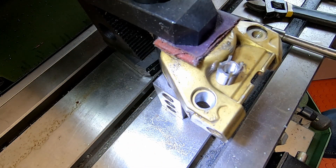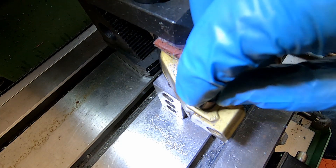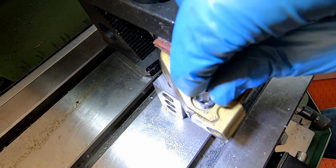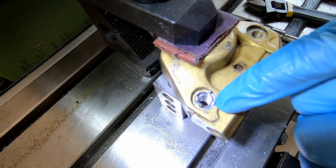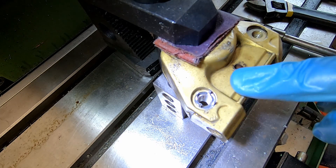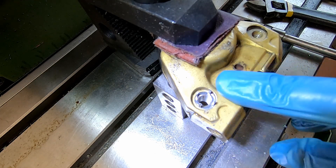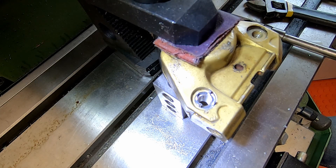This now gives you a close-up of the hole that we've drilled and tapped, and this is our pin lock insert which will screw inside there. You can see how the mechanism works — once this screws in, it'll get down to a certain point and it should start to snag. That's down to its optimum point because these pins are beginning to interfere with the thread. We're about at the position where we would drive these pins in. I'll get this mounted on the vice — we've got a good positive flat surface to drive the pins home. I'm going to do exactly the same process on the second hole, then once I've drilled and tapped that, we'll get back to the bench and get these inserts driven home.